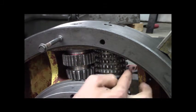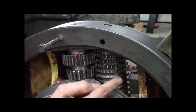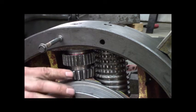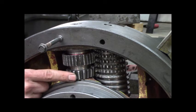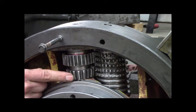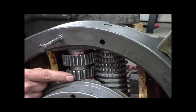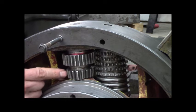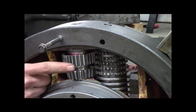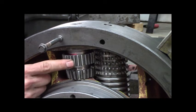The way that the mill is set up, the big ring gear was adjustable from the controls in the milling machine. Mine doesn't have that, so I'm not going to be using that ring gear. But originally it would turn this little bevel gear, or crown gear - which has about a 10 degree inclined bevel - and that's all set up to turn this spur gear.